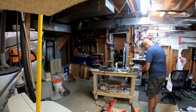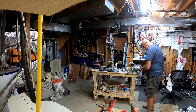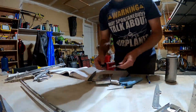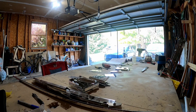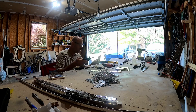When you put the steps in, you have to cut a hole — actually the hole might already be there, yeah, the hole's already there in the bottom skin. But you have to add some doublers and some additional structure to the baggage area where the steps go in. It looks like I don't have a lot of video of those pieces yet in this one since we're prepping for it. But suffice it to say there are probably four or five additional parts, including the step itself on either side, to reinforce the baggage ribs area and to hold the weight of a human as they stand on the step and get into the plane.